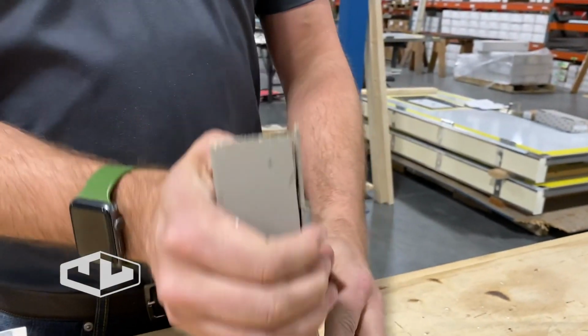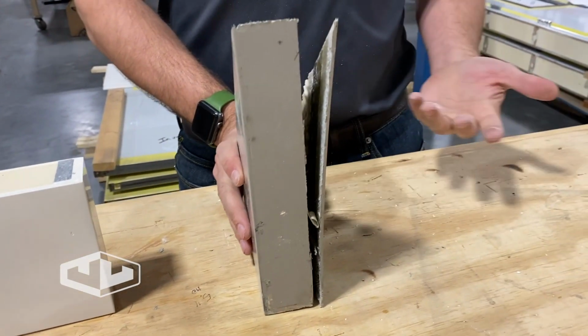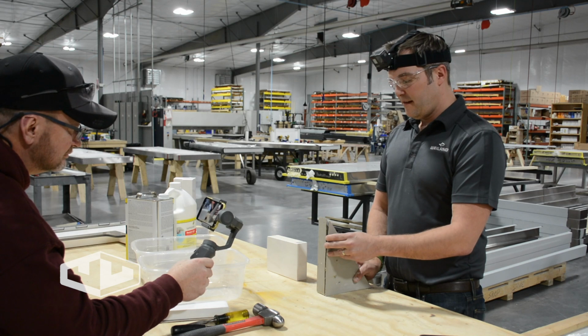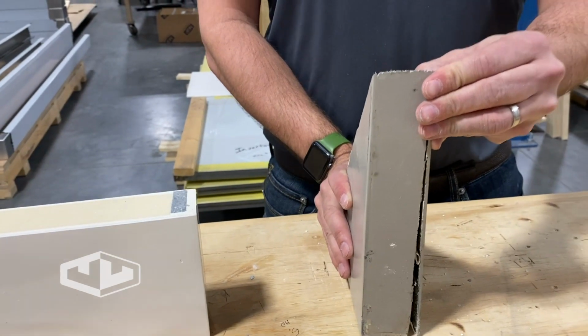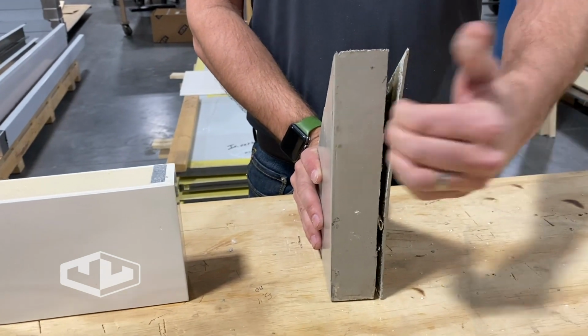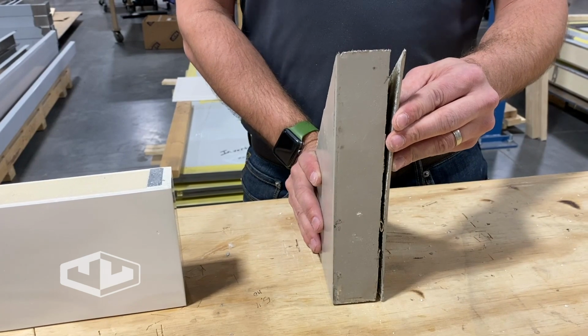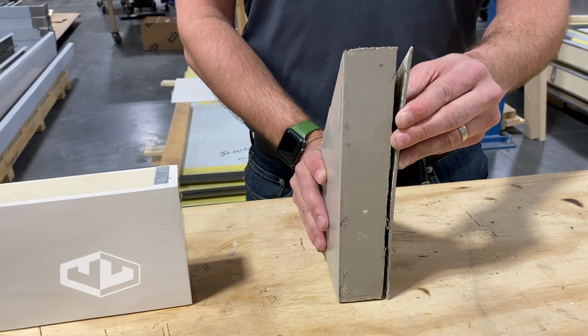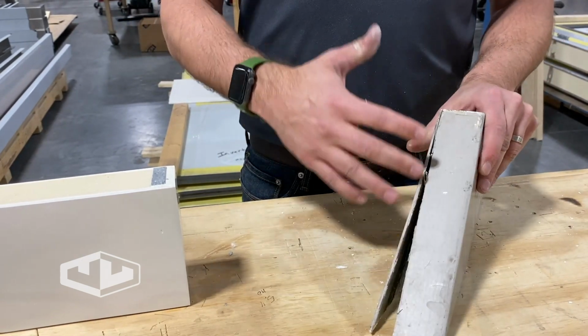The door starts to delaminate over time, and eventually the door has to be replaced because of failure due to delamination. If moisture finds its way into the edge of this door and it hasn't delaminated to the point where it needs to be replaced, moisture can find its way into the door. That becomes a point for listeria and all kinds of bad things to grow that are dangerous in food plants. So we don't like laminated doors.